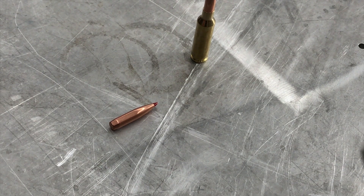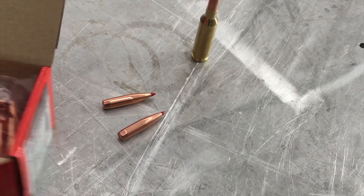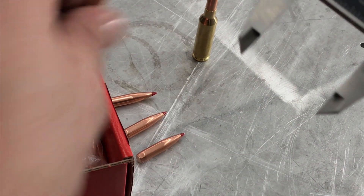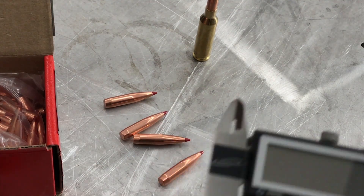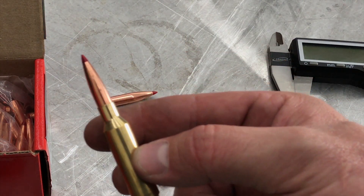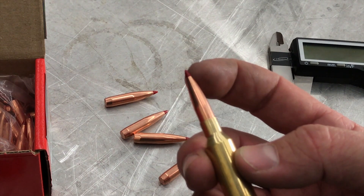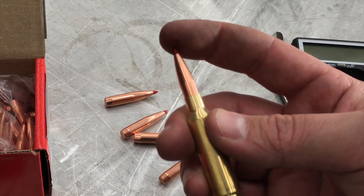Measuring a few ELD bullets right out of the box: 1.375, 1.375, 1.375, 1.375 — you can see these ELD bullets are extremely consistent. So there's not much variation when measuring overall cartridge length at the tip. Whereas something like a hollow point or many other polymer tip bullets will have tips that vary slightly — that's why you would want to measure from the ogive of a bullet rather than the tip.